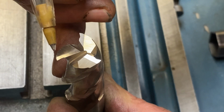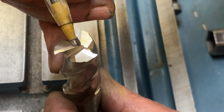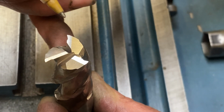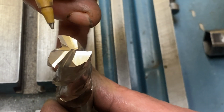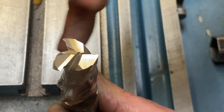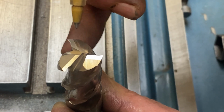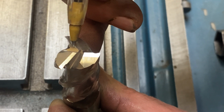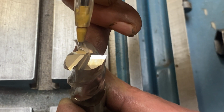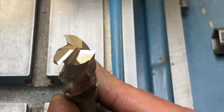All right, so this is the tooth that allows us to drill, and this cutting edge extends slightly past center. The other teeth have some clearances ground into them. This one, you know, looks a little goofy in here, but basically I did have to create a clearance in between this tooth, and so that's where I chose to do it. Now, this is not a cutting edge. This is all well below everything else here, and so this goofy area is just all clearance.